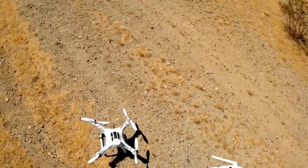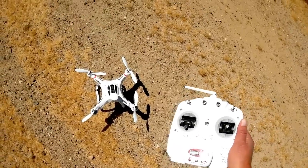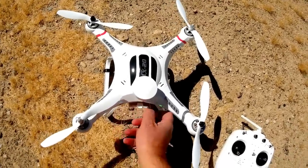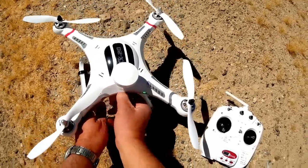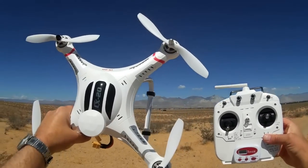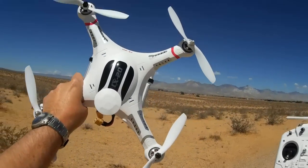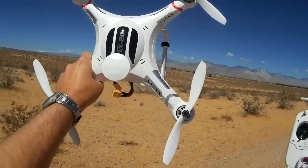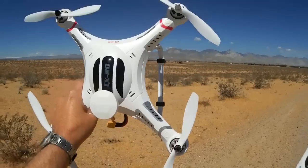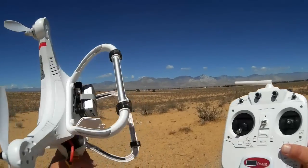We need to lock the blades before approaching. It looks like it's already locked, but I'm going to make sure by pressing the lower button. Apparently when it hits the ground it knows to lock the blades, and now we can approach it. I'm not turning off the transmitter just yet — there are concerns that with return-to-home quadcopters, turning off the transmitter might cause it to attempt to fly back. The blades are locked so that shouldn't happen, but just for safety I'll leave the transmitter on and turn off the quadcopter by unplugging the battery.